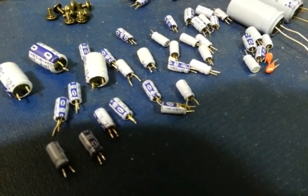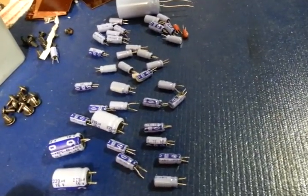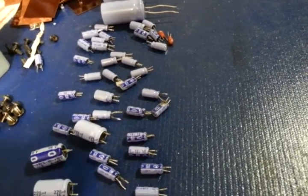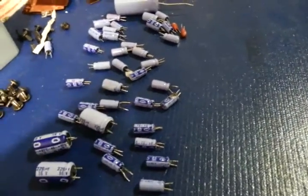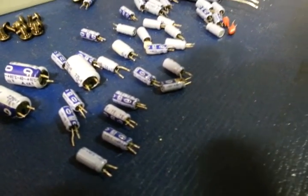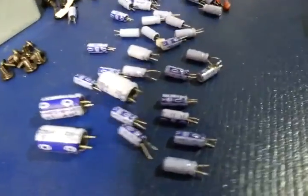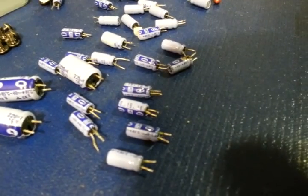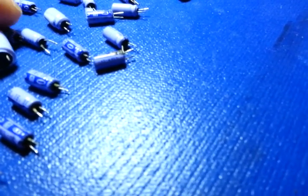It's a nightmare trying to clean all that goop and corrosion off, and some traces were damaged. On the underside I had to cut out a section where the electrolyte soaked through the board, right past the pins, leaked around the solder trace, and corroded out a big section — so I had to do a repair with copper foil. Counting them up: one, two, three... fourteen capacitors were leaking externally, leaking their dielectric out onto the PCB.